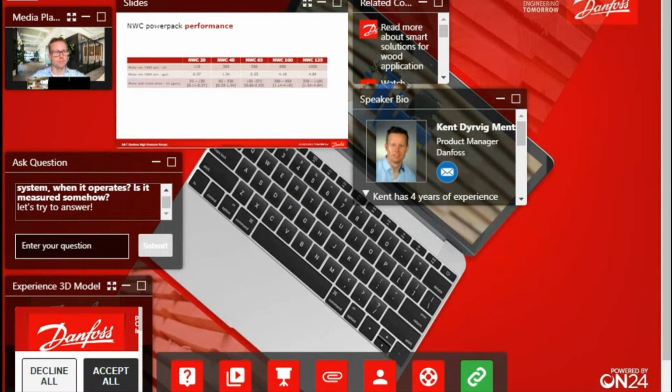As mentioned, the unit comes in 5 basic sizes, which you see here in the table. It comes either as a constant speed version where you have the electrical motor installed. If we take the American units, the smallest unit, when it's running fixed speed 1800 RPM, is between 0.57 and 4.84 gallons a minute. Of this value, as said, 90% of that can be recirculated without the water being heated up. It passes through a relief valve and then returns via the filter back to the tank.